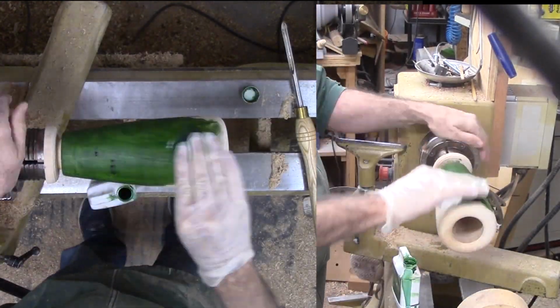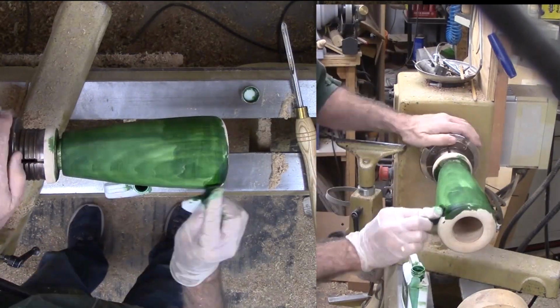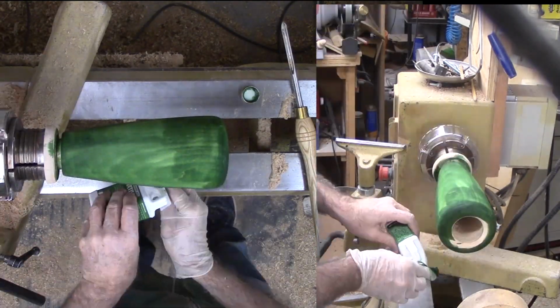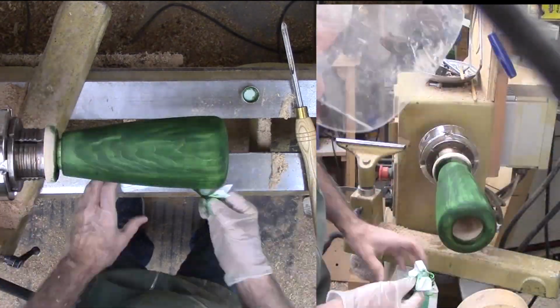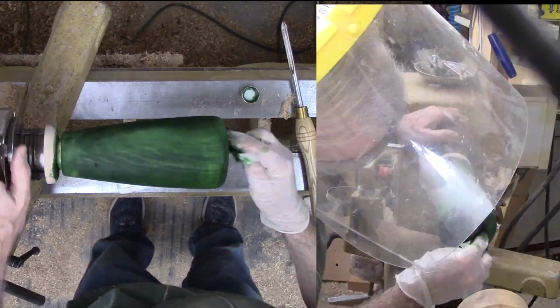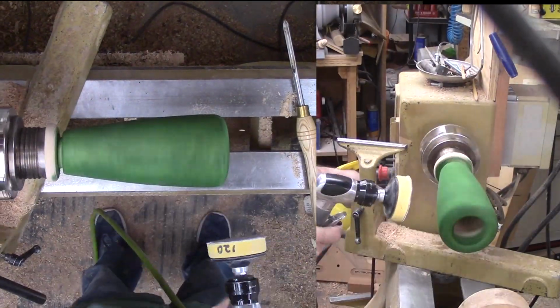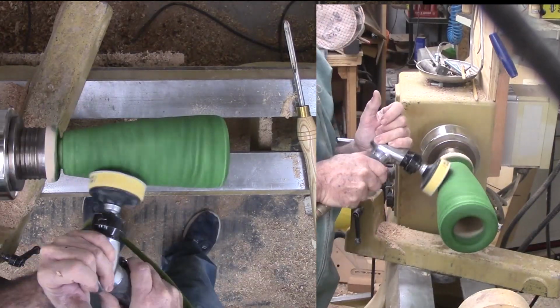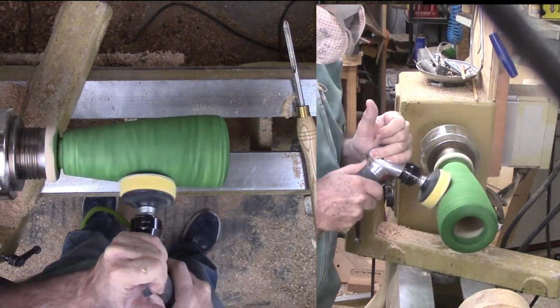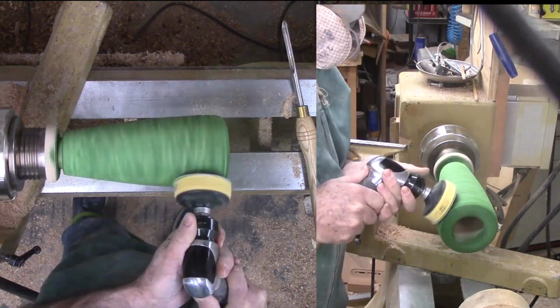Usually, I would thoroughly sand the piece before applying dye. Instead, I immediately applied ample dye to the wood without any sanding. I let it dry thoroughly. The alcohol-based dye dries fairly quickly, even in my cold shop. Then power sand with a 3-inch disc with 120 grit. There are already interesting patterns in the remaining dyed wood.